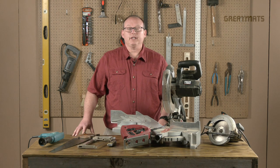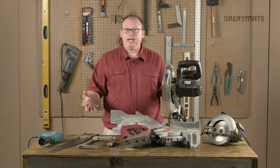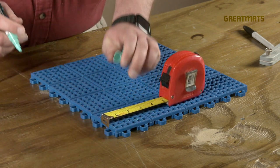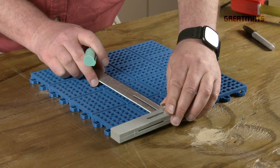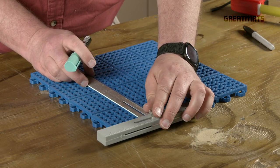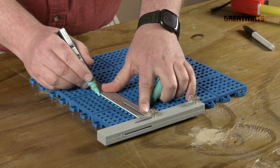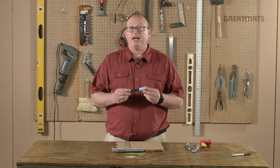Today we'll demonstrate why the motion of the cutting device is so important by using both power tools and hand tools. For all types of cuts, you'll want to start by measuring and marking where you'd like to cut your PVC floor tile. If you're simply looking to cut off the end of a tile, a T-square or a framing square will help you keep that nice 90 degree angle. One thing I find handy when marking is to use a chalk marker because it has high visibility and the marks are easy to remove when you're done.